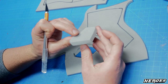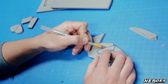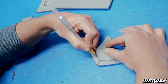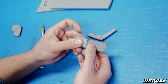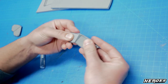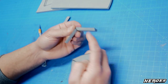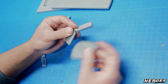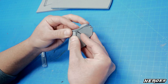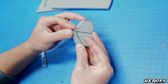This section just needs another inward bevel and the rest are straight cuts. You can see the bevels. This is the front of the chin guard — because we beveled this edge and this edge, once you glue them all together you'll have a sharp angle. The bottom of the main piece is also beveled, so this can glue to this, and this can glue here, giving you another sharp angle. I'll take my time and show you when I glue this together.